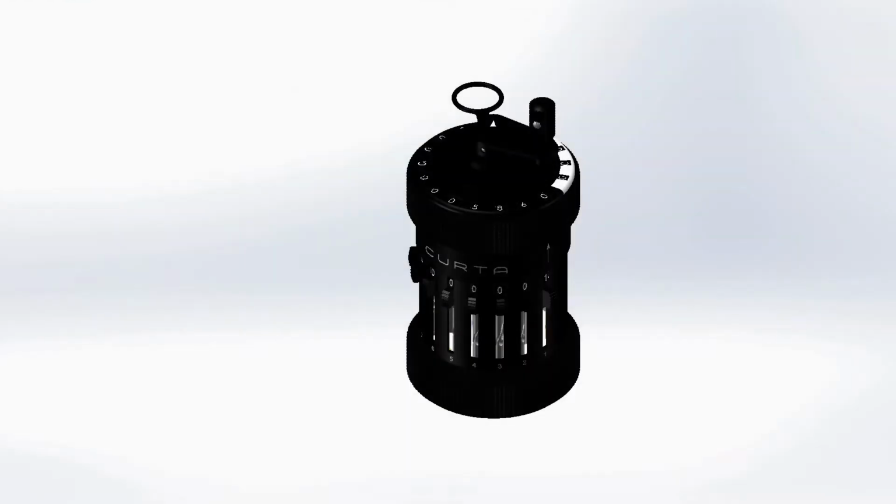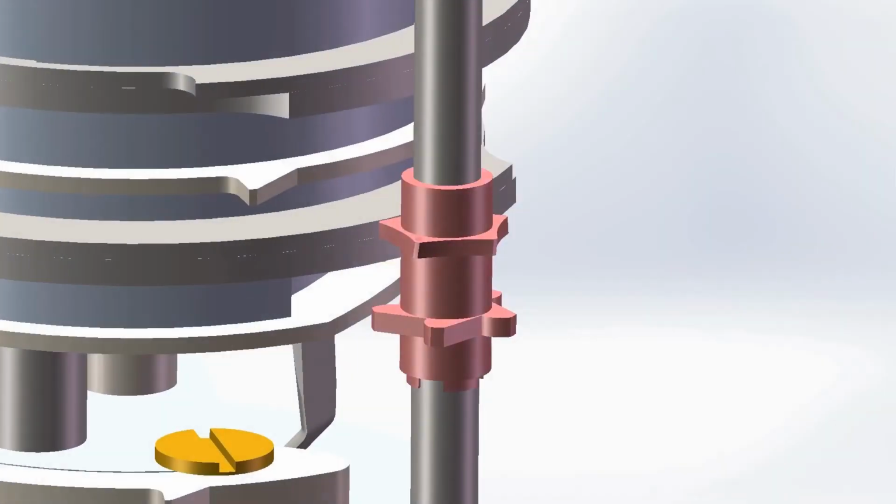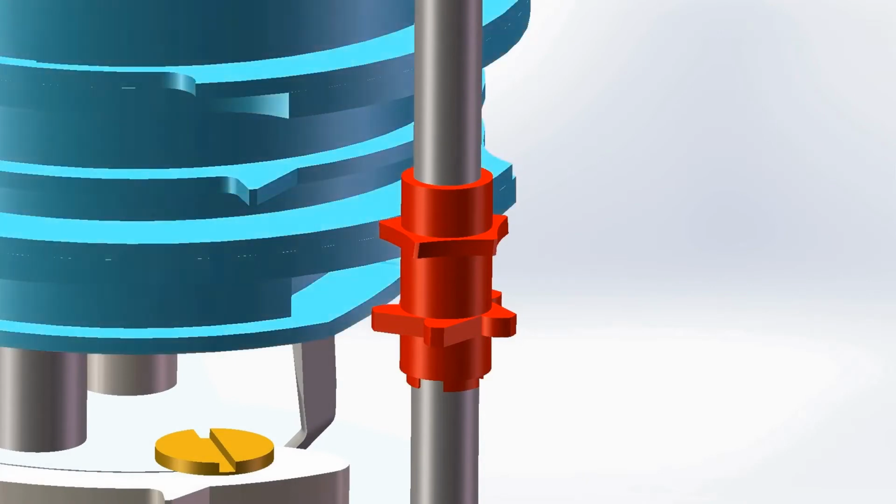In order for all of this to happen smoothly, there are a few measures which prevent errors and improve user experience. One such measure is the locking system, which locks the transmission shafts in place when they aren't being turned by the teeth on the step drum. Returning to the tens gear and locking assembly from the carry system, the upper lock gear mates with either the result counter carry reset ring or the result counter lock ring, depending on the position of the carry lever.